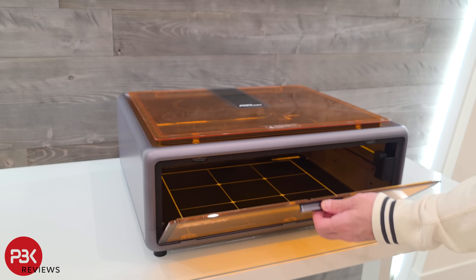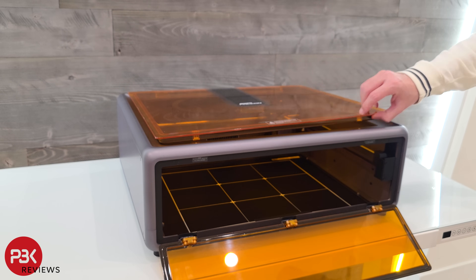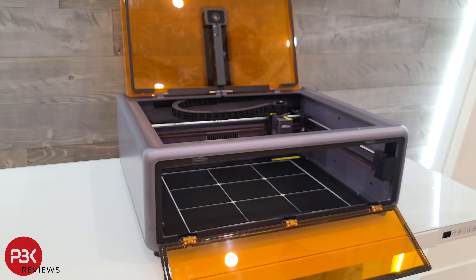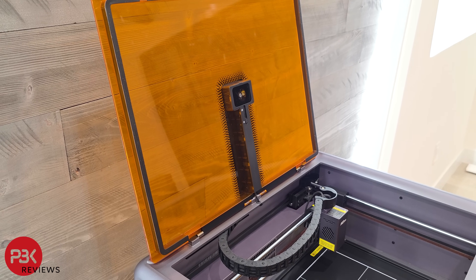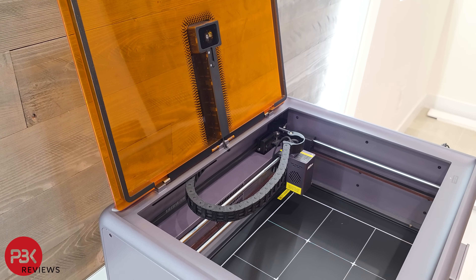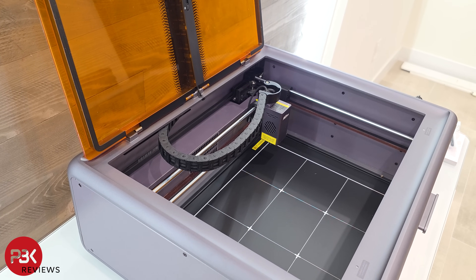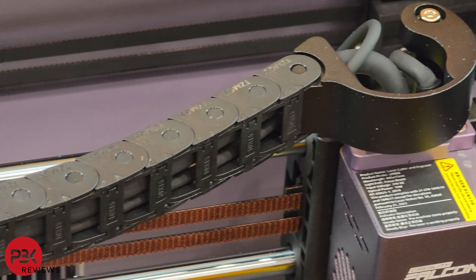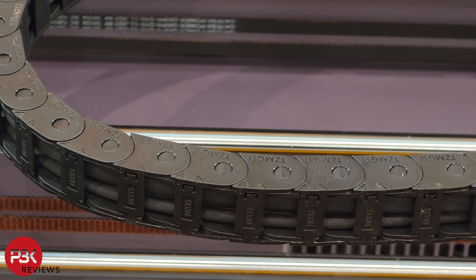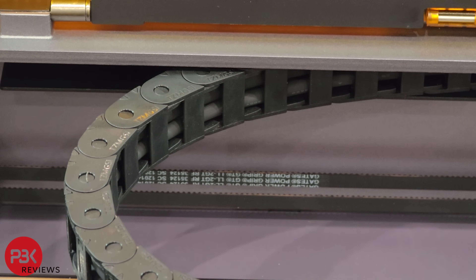What's cool about this is that it's an enclosed engraver which doesn't require the use of goggles. Unlike some other cutters and engravers which require protective goggles, this one is pretty much plug and play. However, you don't want to use this inside your house unless you have the exhaust set up to completely exhaust all fumes and have proper ventilation. The laser burns through wood and other objects, causing smoke and smell you don't want to inhale, so it's best to use it in an open garage, open environment, or workshop.